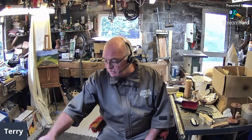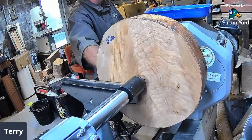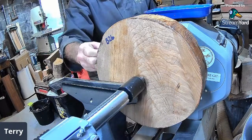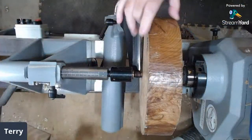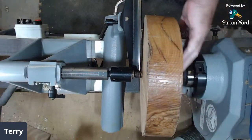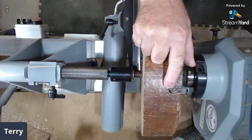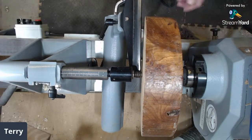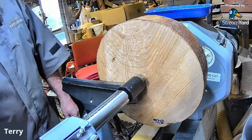Today I'm making a bowl. It's a piece of witch elm donated to me very kindly by Terry Bartlett when I visited with Steve and Mark at the Plymouth Woodturners to watch Les Thorne do a demonstration. It's 12 inches across, two and three quarter inches wide. It's got a huge inclusion on the back end. I've glued it up — it goes down about an inch — and I've put a face plate on it and screwed it in. Hopefully it won't fall apart.